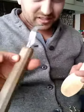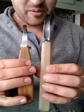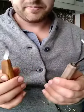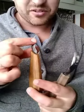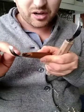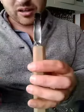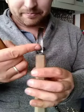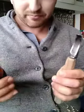Okay, so let's talk about hook knives for a second. There's two types of hook knives in this world. There are those that have tram rails and those that do not have tram rails. Those that do not have tram rails get sharpened on the outside, which raises a burr on the inside, which you then use a dowel or a ceramic rod to remove the burr. But you do not sharpen them on the inside, you sharpen the outside bevel. Those that have tram rails, you sharpen on the inside. And that raises a burr on the outside edge, which you then remove by stropping.